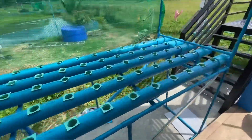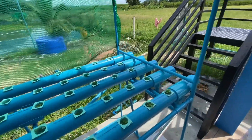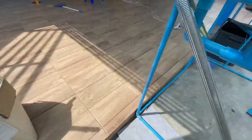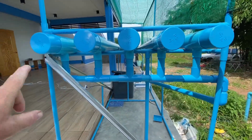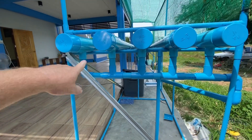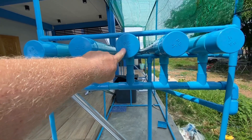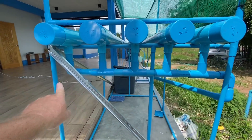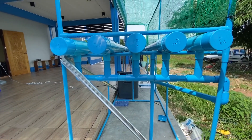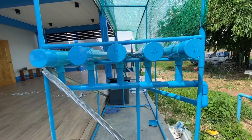The water flows from there, down all the way here, and we've got a tee piece. This is an expensive way of doing things. I've put a tee piece in — this is two-and-a-half inch pipe, this is one inch. This doesn't really need to be done like this; what I could have done is drilled a hole in the cap end and had the water just pour out into a gutter, with the water flowing back via the gutter rather than the pipe. But I wanted this to be more of an experiment to see if it works.